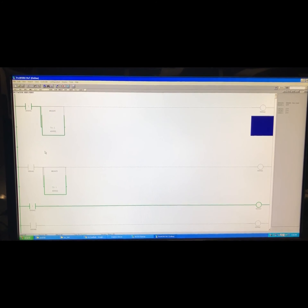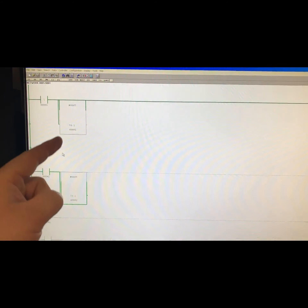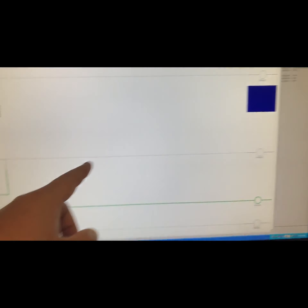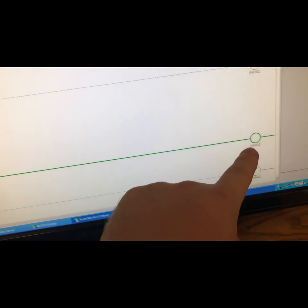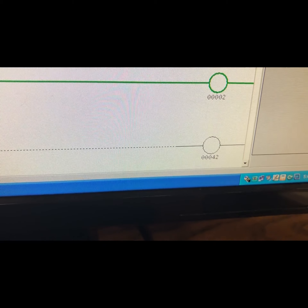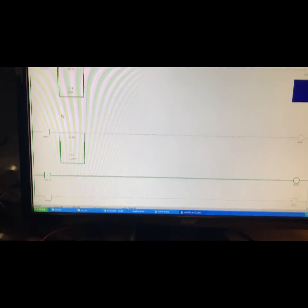Here at the PC, connected live to the PLC — you can see I have a half-second timer running. Two timers are essentially fighting over a bit, so it's on for half a second and off for half a second. I take a normally-closed contact of coil 41 and drive coil 2, so they're just opposites of each other — that's why on the HMI you see on/off/on/off for those two coils. When I press the button on screen, that button is address 48, and the button turns green. Coil 42 is the indicator above the pushbutton, driven by the logic.